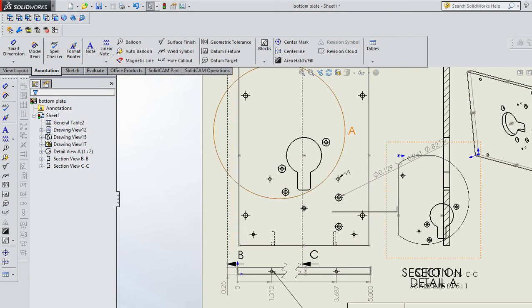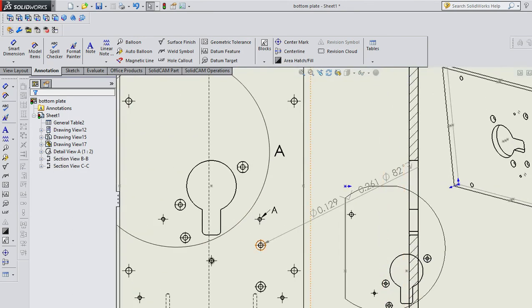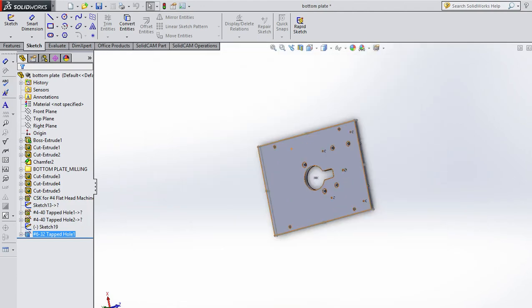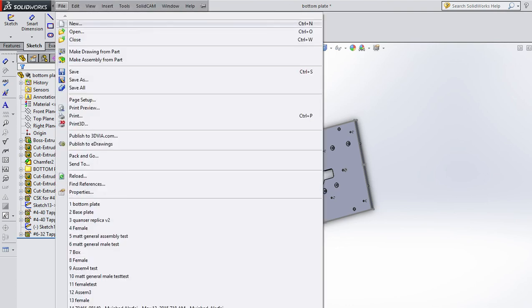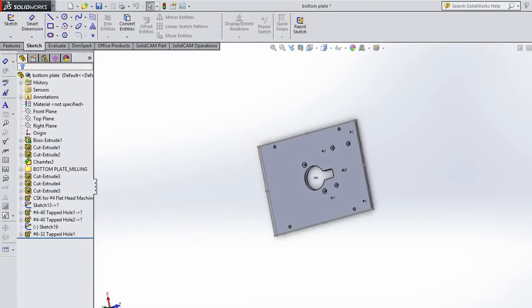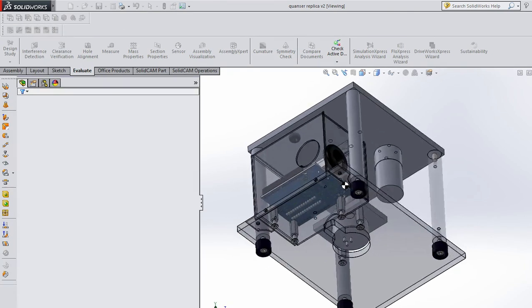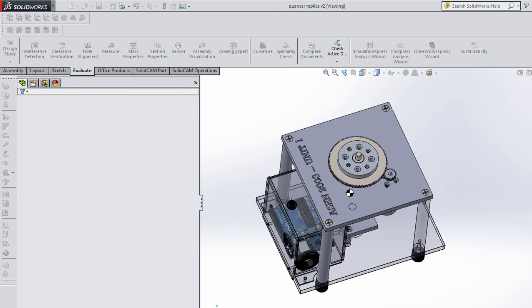And again, I'd want to put four places or put that in a table. What does 82 degrees mean? So the 82 degrees is that standard screw size. And that's because you as the engineer wanted to put an 82 degree screw right there. And that is because it was bolting that base plate to the pillars. Right here. Or up here. See that?